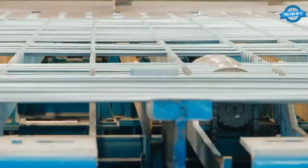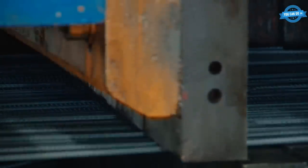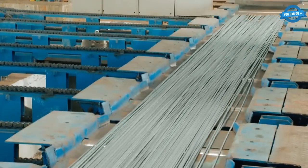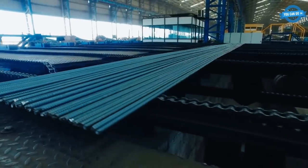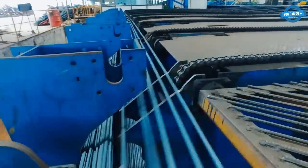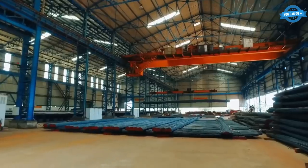For slabs and billets greater than 140 mm square, the route avoids the finishing mill. Instead, the steel goes across T3 transfer — facilitated by dropping the V-rolls — and through the bloom flying shears, traditionally known as P9. One feature of the huge size of the mill is that the shift craft teams have to use mobile plant, in this case a golf buggy, to get from job to job. After the bar sorts are carried out, the ingot packs move across T4 or T5 and down the racks to the cooling banks.